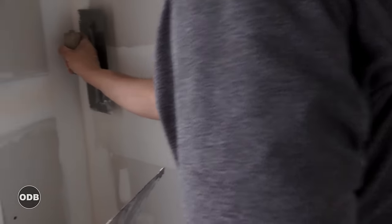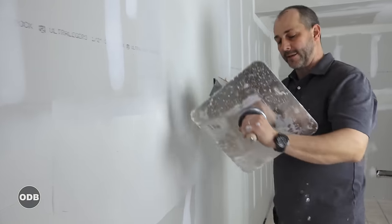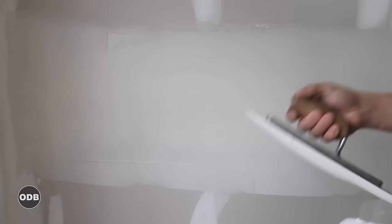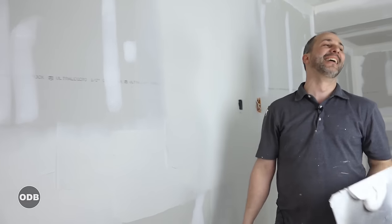Because it's final coat, we're going to take advantage of the thinner mud we made and apply it over our horizontal joint. This horizontal joint doesn't need any more mud — it's already filled, everything is fine. What I'm doing is making sure that the whole wall surface is nice and smooth and uniform so that when I'm sanding I'm getting an amazing result. We'll come back into this corner, go with some pretty significant pressure — put it on, take it off — going with a lot of pressure on the drywall side. You can see how large an area is kind of foggy; that's very, very thin mud. When that's dry you'll be able to sand it just by passing the block and it's done.